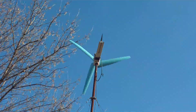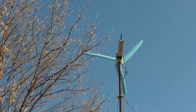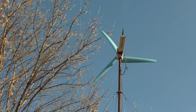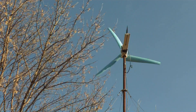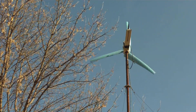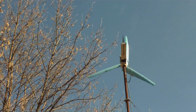I put up this wind generator I built about three years ago. There was a guy on the internet who said that if you build it out of PVC pipe, the blades will come apart in four months. Well, three years later the thing is still running like a charm. I had one problem with the hub getting worn out where the set screws came loose. What I recommend is putting a pin all the way through — drill a hole through your hub and the motor shaft and pin it right to it. That's probably a better idea and you won't have any trouble.